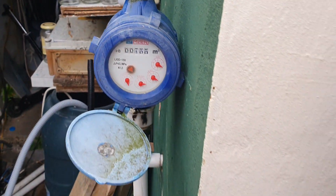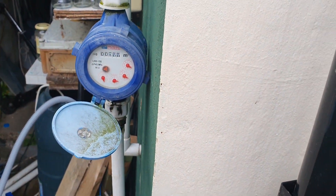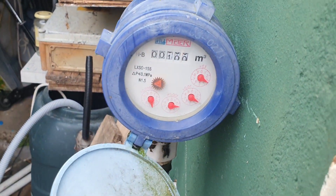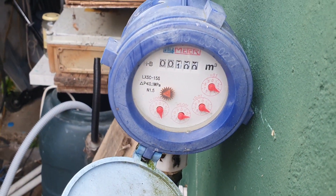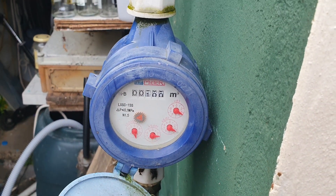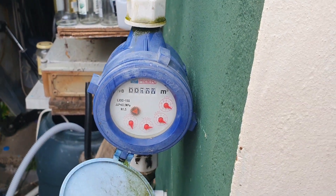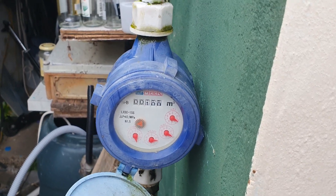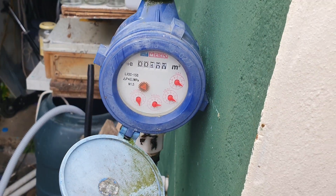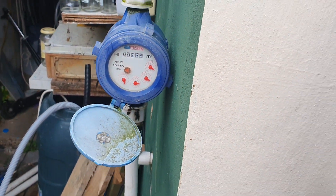Now I really want to make this into a system that I don't have to maintain. However, the loo has to be disconnected from the mains water in order to comply with the regulations, and so in times where we run low or run out of water completely, I have to fill this with tap water and remove the meter — hence why it's a little bit green and nasty.